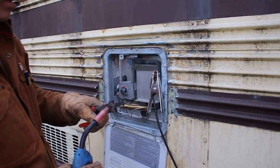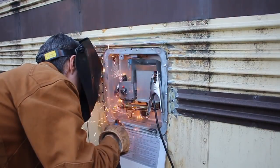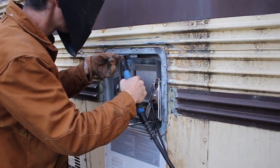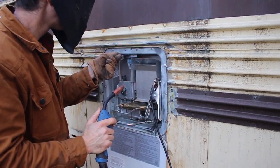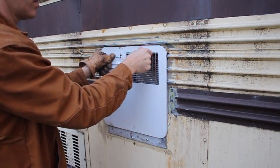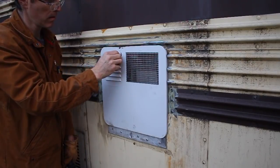You'll see a couple of welds here — one is to reattach the hinge that holds the door on. It just had a chintzy piece of metal that was not doing the job, so I welded that back on. Then I wanted a more solid connection on the top of the unit, so I welded a bolt in place. That bolt goes through the pass-through on the top of the door, and I just close it shut with a wing nut — which is in my mind more solid and secure than the previous spring-based closure that was originally on the heater door.